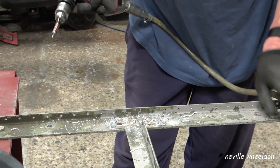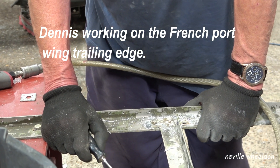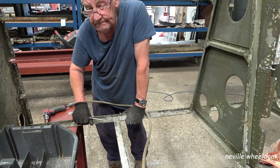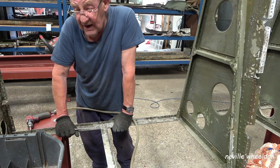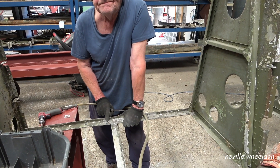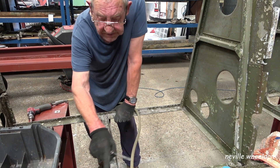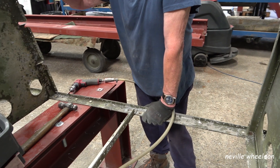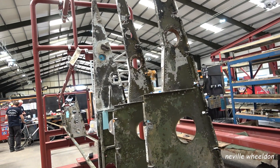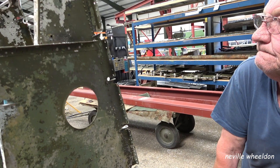Morning Dennis, are you alright? You've done a good job here — you've got a lot of the ribs off. Yeah, some of them are going to be quite difficult. The bolt heads are coming through underneath — when you try to get your ratchet or spanner on them, they're just rounding off, because you need that much force to crack it. About two or three of the heads have sheared off. Underneath, this angle is riveted down and then you've got these on either side, so you've got to take each one out and pull it out with the appropriate leg on the rib — so when it goes back, you know that that bracket fitted that position. But it will get there in the end.